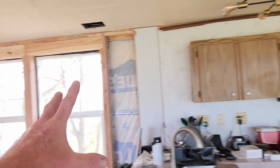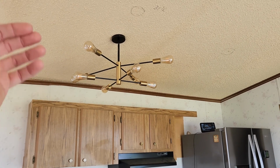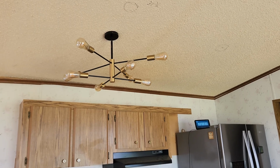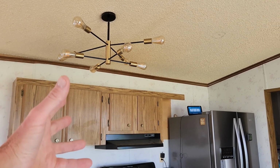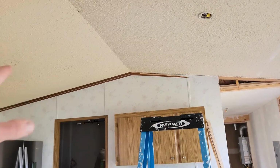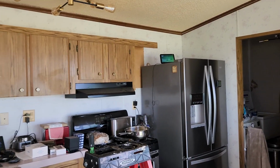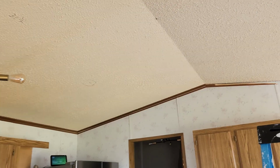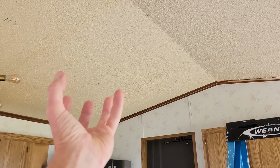So the idea behind this is that when you are eating while watching, because I do like to eat on bi-weekly cheat Thursday pizza nights or Sunday cheat day, and that's the only time I really watch shows or movies these days. I like a little bit of ambient light, and so you could have either the pendant lights on here or the pot lights, or eventually the under cabinet lighting. It's a lot, but I already have the resources, so might as well put it in. So those are super easy to put in. Take your drywall knife, cut around the template, insert the 6-inch light in.